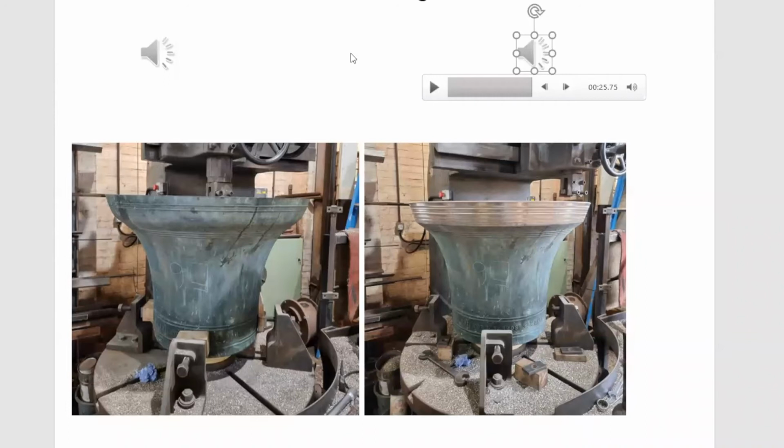And with internal tuning, you simply cannot attain that level of improvement. If I had cut the bell internally, I could have flattened the hum, and I could have got it down to a flat 7. So I would say 3/4 of a semitone sharp of an octave. But in flattening the hum, I'm also flattening the fundamental. That's getting lower all the time because you cannot adjust any of these partial tones individually. So although I would have got a flatter hum, which would have given the bell a little bit more body, a bit more oomph, the fundamental would have remained at least 1/2 a note flat, if not a little bit more. But with this external tuning, I was able to put the bell properly in tune.